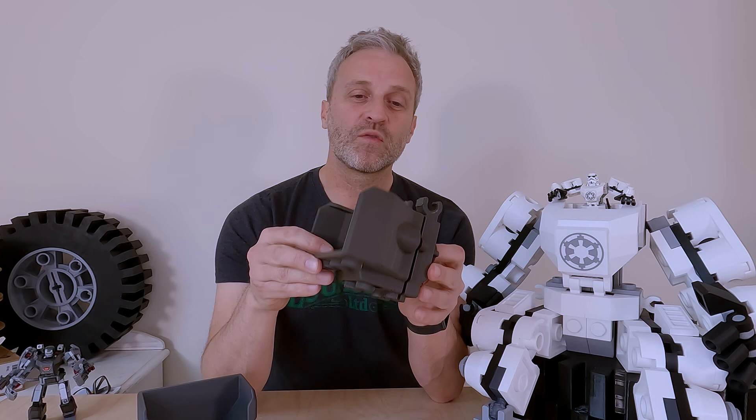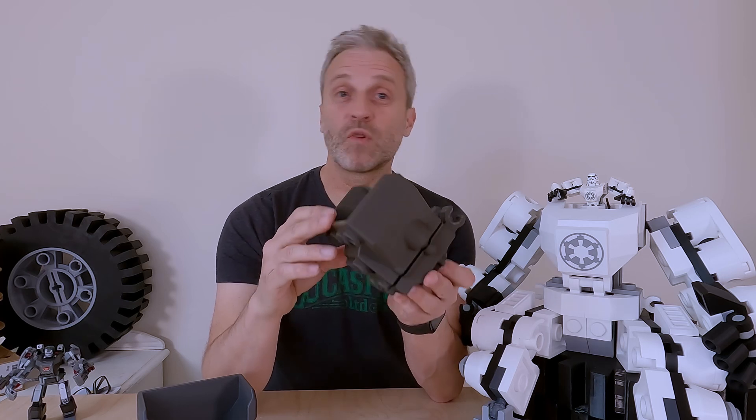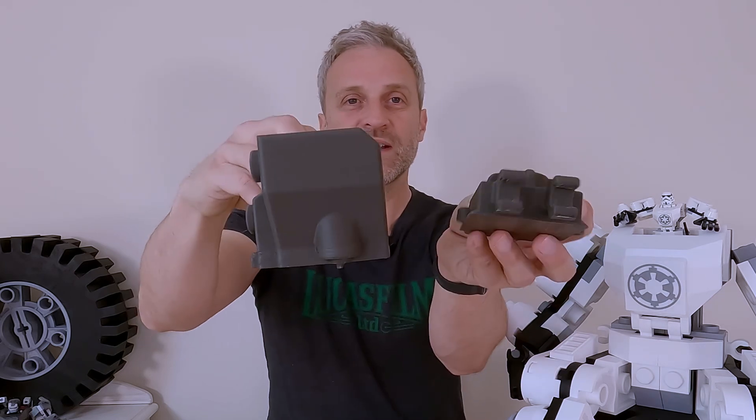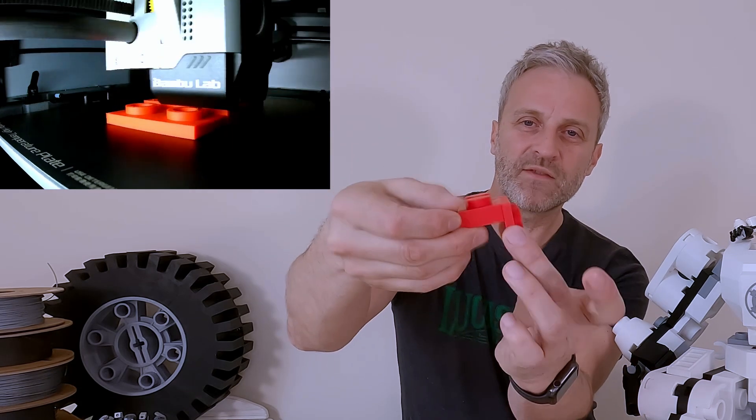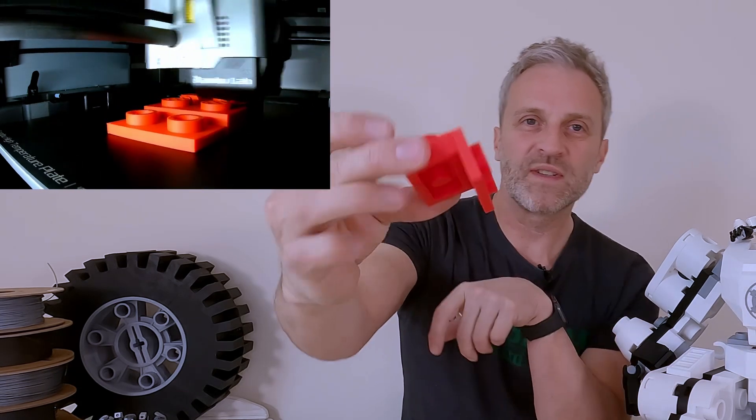It's actually much better to CAD the part from scratch, or at least use the model as a reference. My friend Scott scanned that part for me and then took it into a CAD package and modelled most of it up. When it came to printing, I simply sliced it into two parts and glued them together. This part here is glued to this part so they're both printed flat on the printer. However, when I came to another section I decided to start playing with tree supports instead — printed straight on the printer in one part, with the trees supporting just the overhanging pip areas.